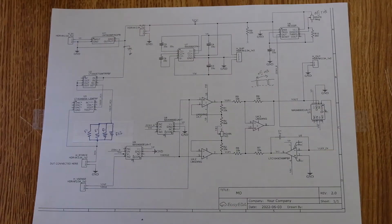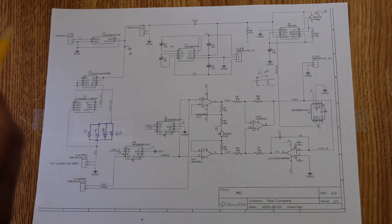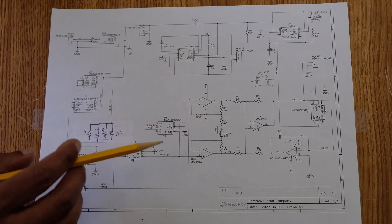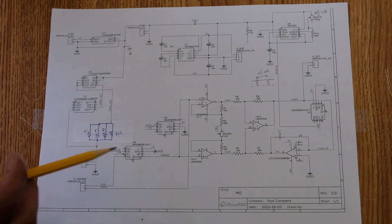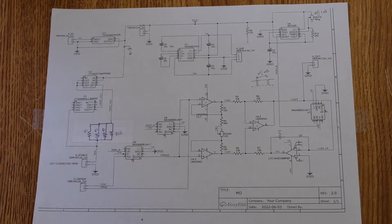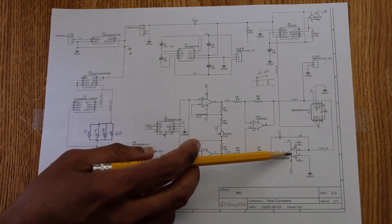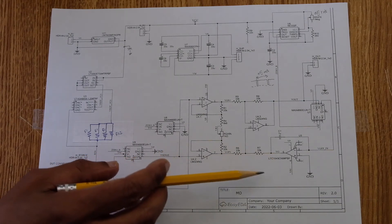The output in millivolts corresponds directly to resistance in milliohms — that is why a gain of 10 in the instrumentation amplifier is important, to avoid mental arithmetic. The trade-off is dealing with gain errors and offsets, unlike a pure 100mA current approach. Offset compensation is performed using the LTC1049, a very low offset amplifier specified at 2 microvolts offset with low drift.